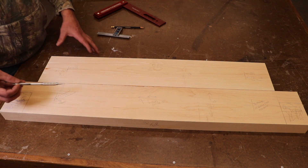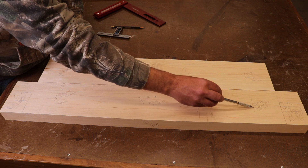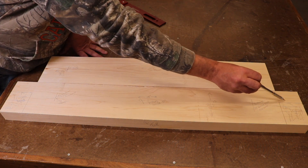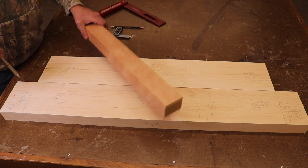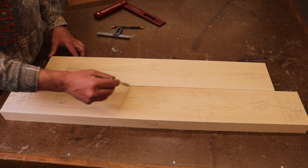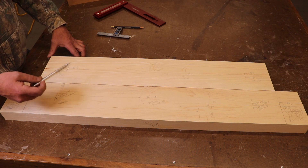That's really all of the layout marks. These two holes are three-quarter through holes, but before we do that we need to do an inch and a quarter — or a little bit smaller — Forstner bit first to 13/16 deep, and then chisel around the nuts because those nuts have to get buried in there. Mine also differs from the plan because I'm going to notch out these corners so I can put F-clamps on them at the bench, or hold on the holdfast using the support block. I also noticed a little tearout in this board — it's shop furniture so I'll put a little chamfer on it and live with it.